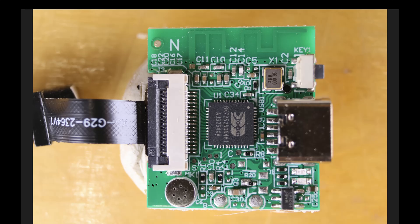This is the main circuit board with all of the rest of the electronics. We can see the camera coming into this ZIF connector here. The star of the show in the middle is a single chip which looks like it probably does everything — basically a standalone chip with a Wi-Fi interface. Lots of technology going in there. We'll decap that one in a second. There's also a 26 MHz crystal. Let's see if we can decap that one and see what we can find.